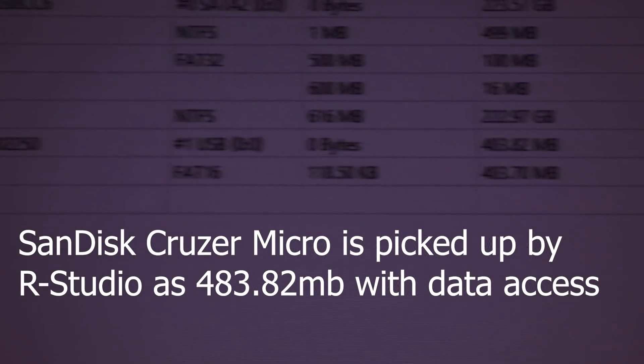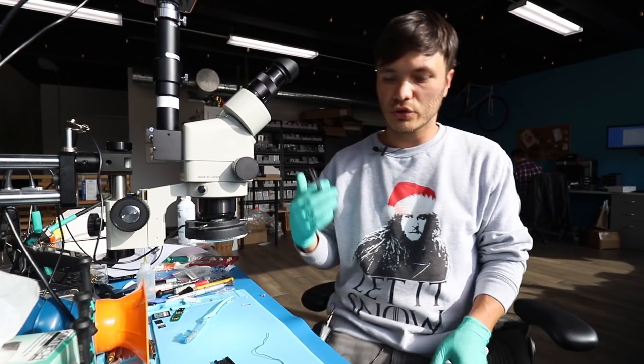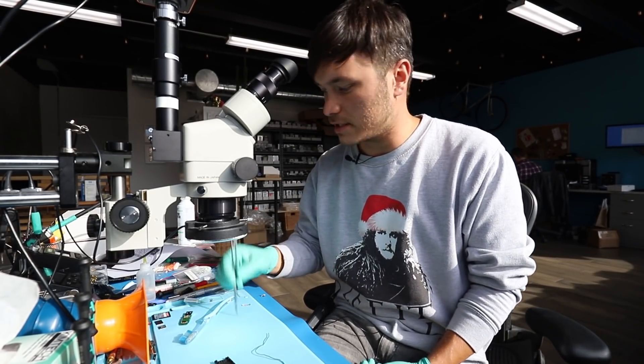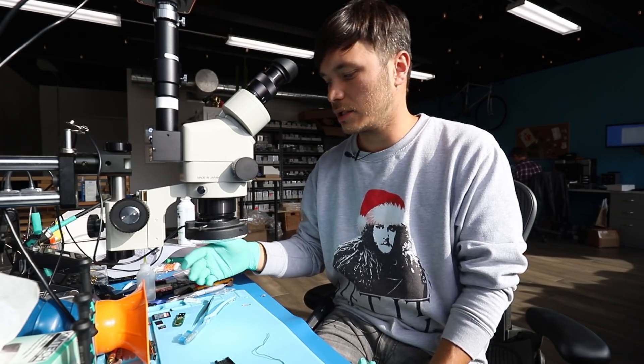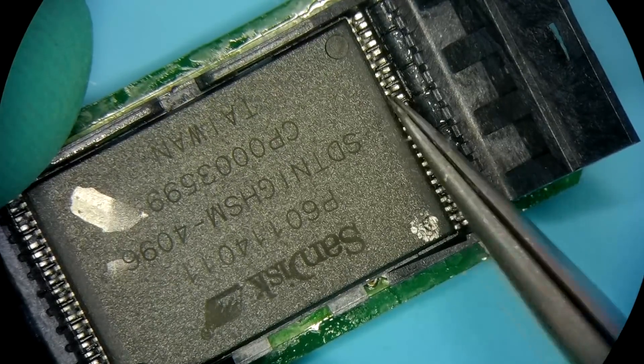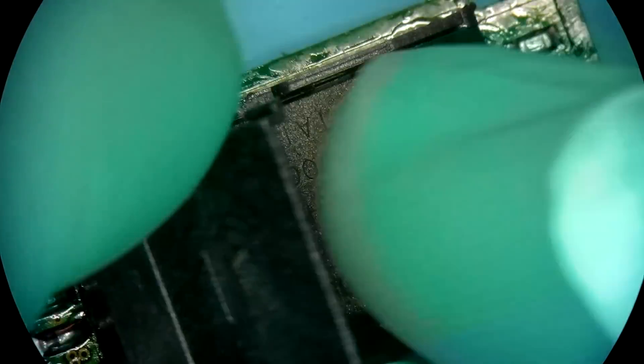Let's test it out. You've got the light — and what do we have here? The 512 megabyte unit. Let's close this up and go into our viewer. As you can see, it came right up — that's the data. Without a compatible donor, this is just not going to happen. Also, the fact that I had these sockets is beneficial — we don't have to do much in terms of the NAND, just remove it, clean it, and put it back on the board. Click it in and good to go. I'm going to go ahead and copy this data for the client. Thank you guys for tuning in — I'll see you next time.